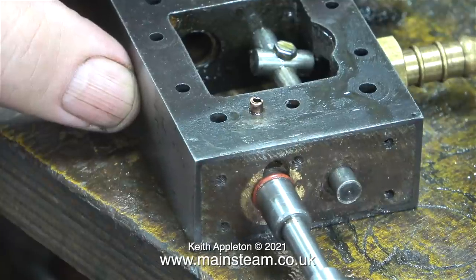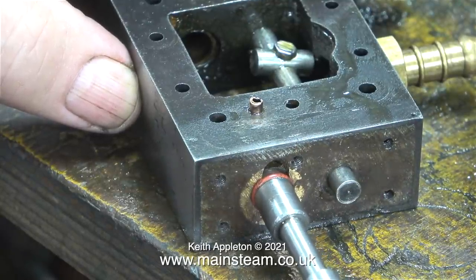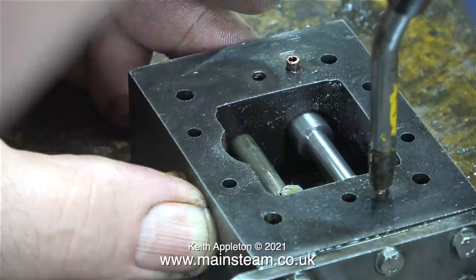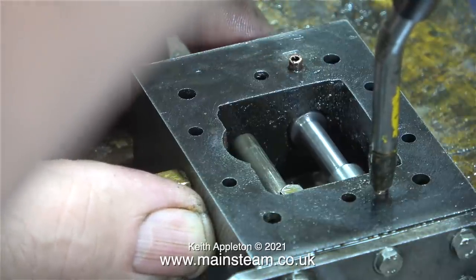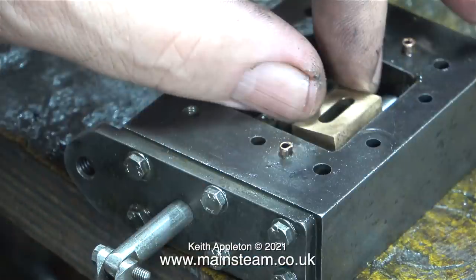In this clip I've fitted a silicone o-ring into each of the grooves at one end of the shuttle piston. The groove isn't wide enough or deep enough and the silicone o-ring is far too tight, so I removed it and I'm going to use just one silicone o-ring at each end. When I refitted the shuttle piston into the cylinder and tried some compressed air, it was in a different class — a lot more power and no sticking.